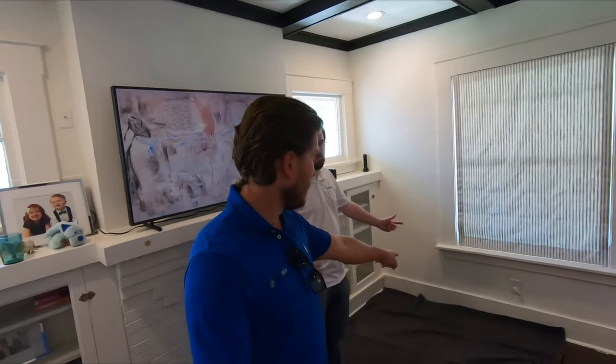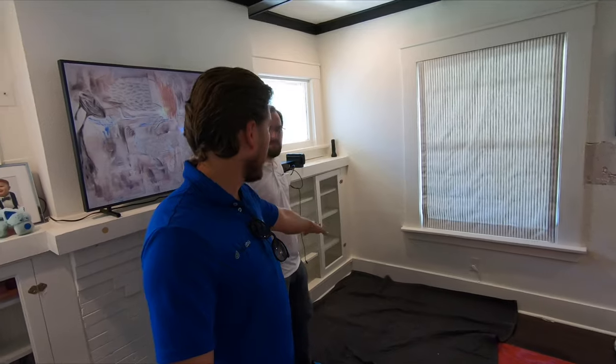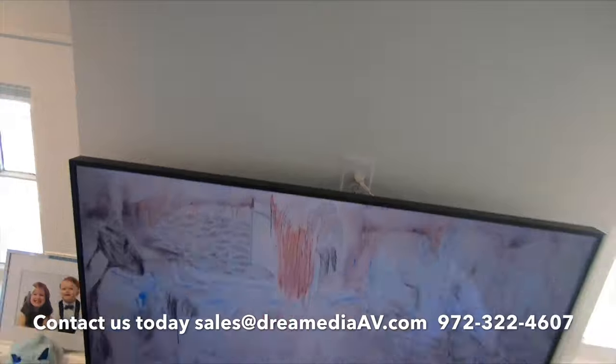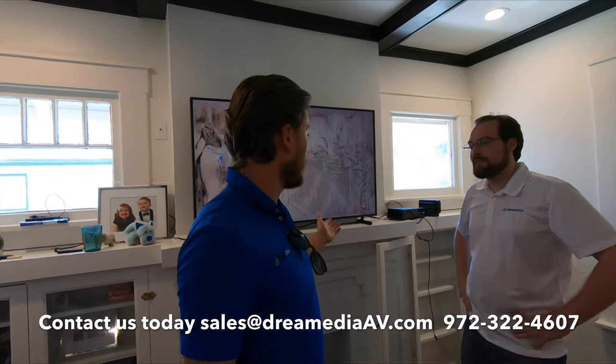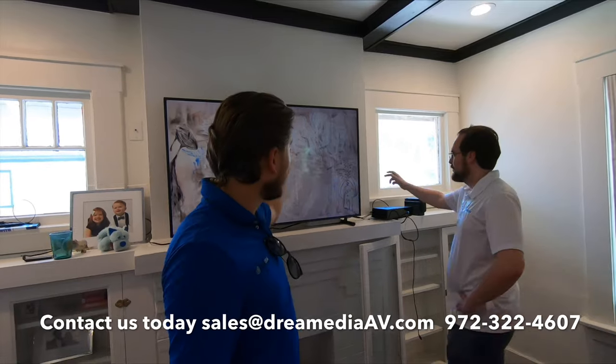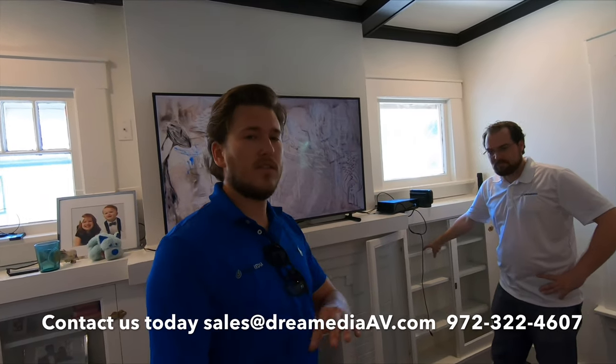What is up guys, this is Zach and Sam here with Dream Media Home Theater, and today we are going to be installing a Frame TV over this fireplace. This is an older home down here in Fort Worth, Texas and there is no wiring in place. We're going to be installing an outlet that is over here and moving it into the cabinet so the customer can plug in the One Connect box there, and the outlet that's actually up top is going to go away. All the power is transferred through the fiber cable, so we're also going to try to fish that fiber cable through the wall down to the cabinet so that there's nothing showing. Older home — wish us luck, we'll let you know how it goes.